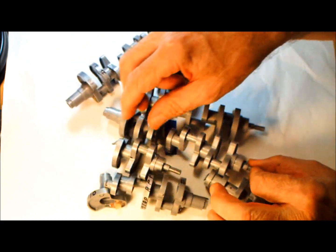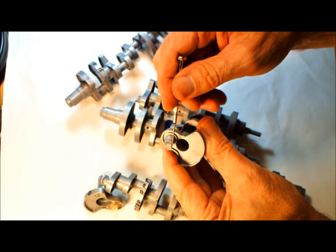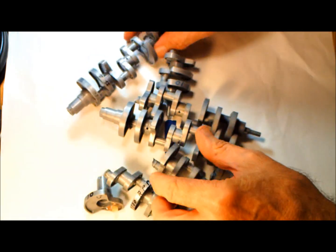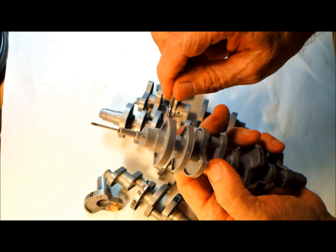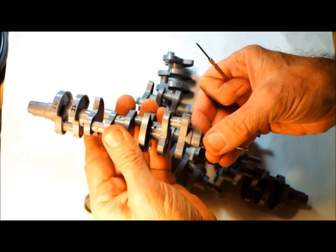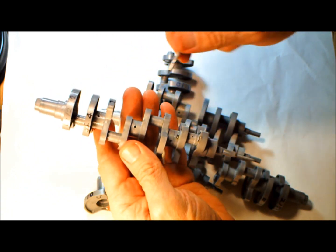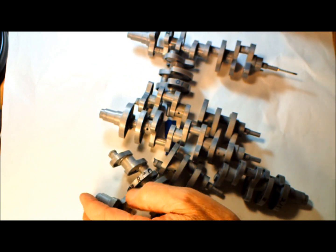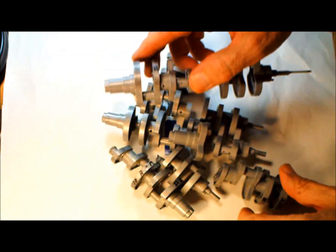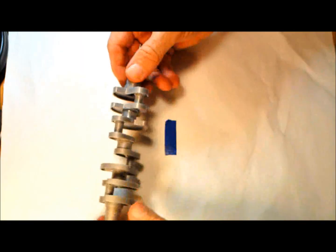One of the problems here is meltdown. I don't know if you can see it in the video, but this crank pin has melted down. This crank pin is melted out of shape. It's melted off at an angle here. At these high speeds, it gets hot and melts down. So it's been a real challenge to overcome that, and I've managed to more or less overcome it.